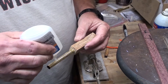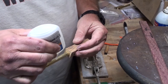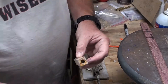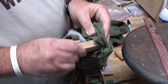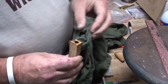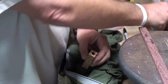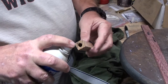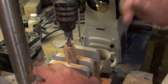Ready to glue the tube inside the Virtuoso pen. Anybody that tells you one drop of super glue is enough — they're wrong. Let the excess glue off, then it has to sit for a little bit for the glue to have a chance to completely adhere. Use a little Stick Fast activator to make sure that it sticks to the tube. The glue's had a chance to dry.